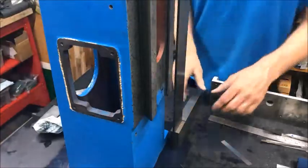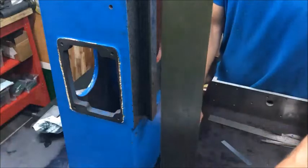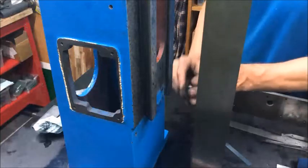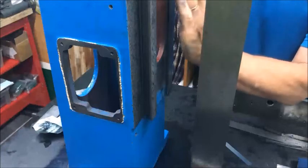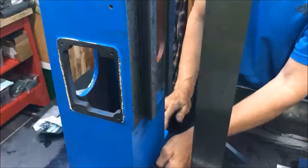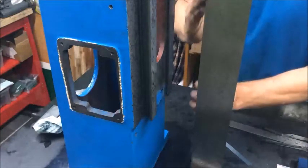By careful measuring from the sides, I've established that the column is leaning a little bit towards me now, so I have to correct it by scraping a little bit more on that side. And it's leaning a little bit backwards — not much, but a little bit — so I have to correct it by scraping here.